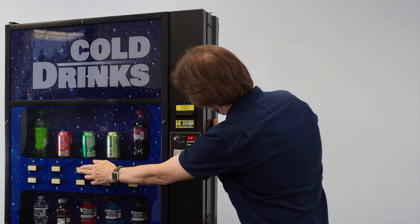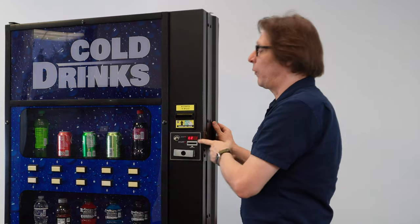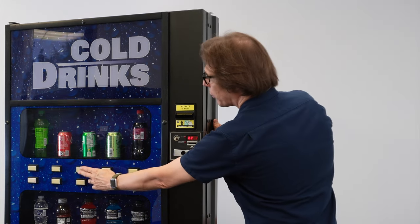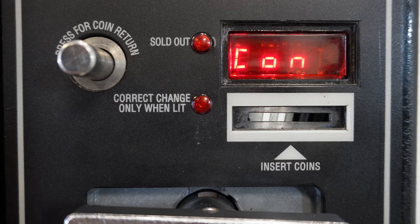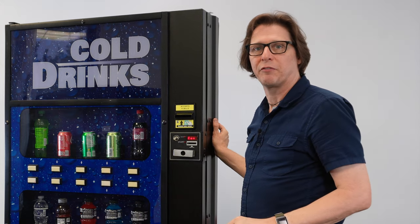I'm going to bring this back to a 1, then tap selection button 3 and press and hold it until the number stops blinking. At that point I've now unlocked that fridge menu. I'll press and hold selection button 3 until the display reads CON — C-O-N — and now I can move forward to find that fridge menu.